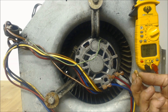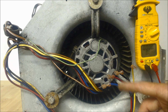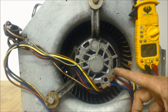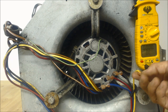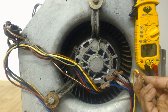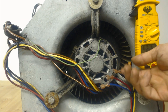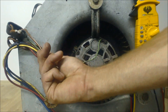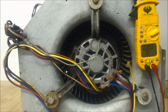The yellow wire is going to get attached on one side of the contactor on an outdoor package unit. Then depending on which speed you have it set at, that determines which other wire gets powered as well. One leg of the 120 volts powers the yellow wire, and one of the speed wires gets powered with the other 120-volt leg. Wherever the yellow connects, it's also going to connect to the brown/white inside the blower motor, come through the capacitor, and into the start winding.